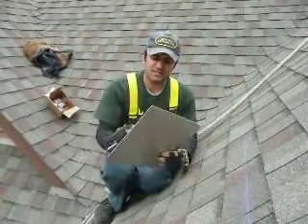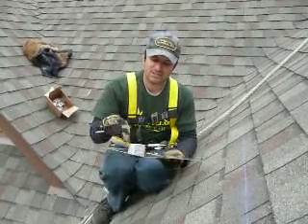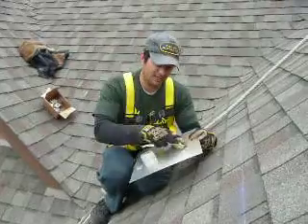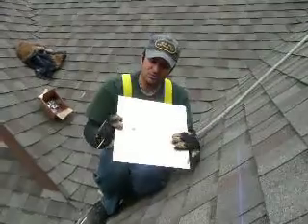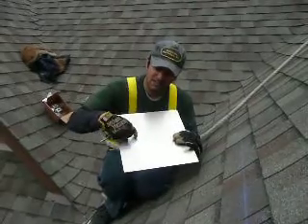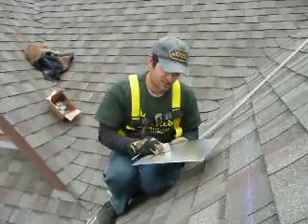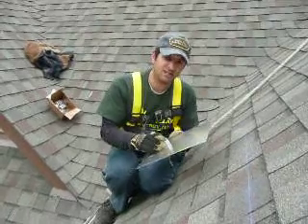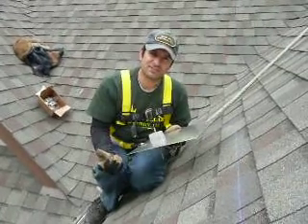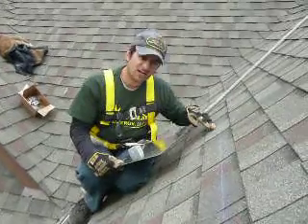The other thing that's really nice about this is the footing is attached and it's actually sealed. So if water was to ever get into this little crack right here, it wouldn't go any further — it goes around because this is actually sealed up. Once you drill this in there and lag it down, there's no way water is going to get in there at all.